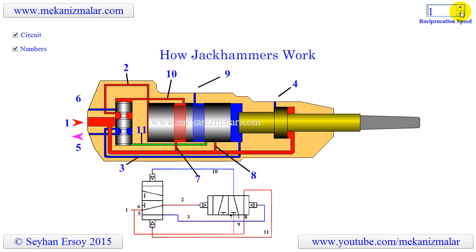Let's slow down the motion of the jackhammer to see how it works. When the operator pulls the trigger, compressed air enters the spool valve from the large internal opening at point 1. When the internal pipe at point 2 becomes red, air is pushed behind the piston forcing it downward. At the same time, air at the bottom of the piston is exhausted to atmosphere through pipe 3. While the piston is moving downward, air enters the back of the shock absorber chamber at point 4. When the operation is reversed, pipe 2 becomes blue and pipe 3 becomes red.